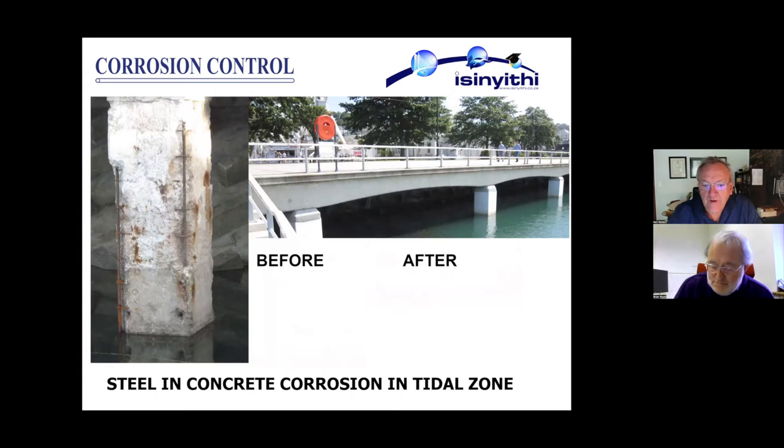Going back to that slide showing piles, piers, and water — that begs the question that seawater is very high in chloride, about 3% salt, and yet generally we don't see immersed structures suffering from the same problem. How come? Well, if the immersed structure is fully water saturated, then the pores in the concrete — which is a porous material — are all filled with water, and there is insufficient oxygen transmission through the concrete to maintain any significant corrosion rate.